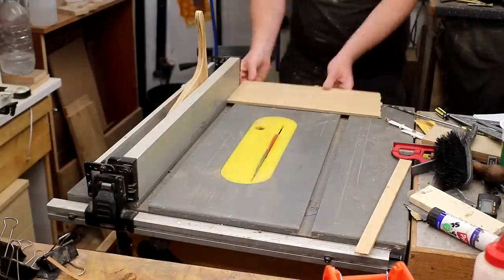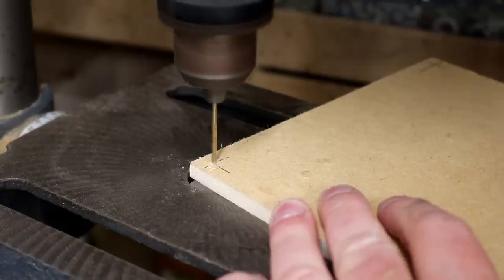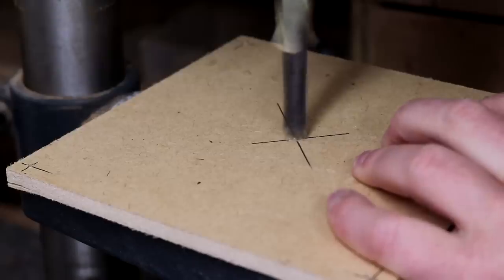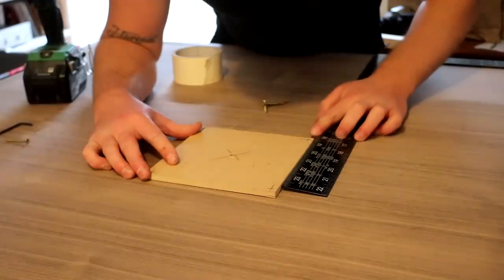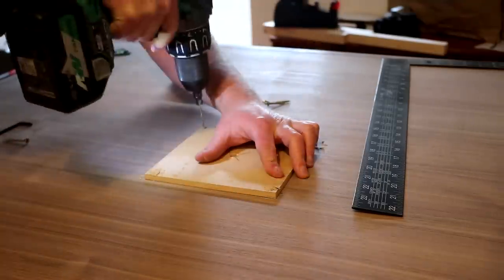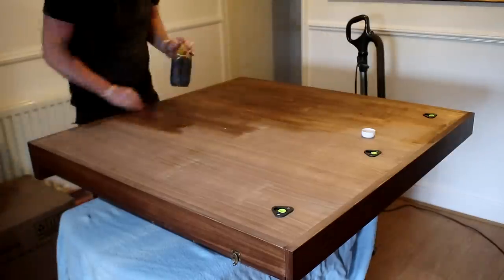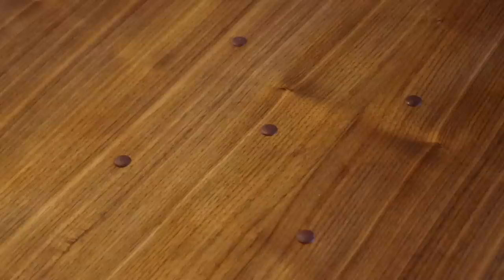At the table saw I cut a square of MDF to make another drilling template. I marked up four corners and a centre point, drilled the corner holes at 2mm and the centre hole at 8mm. I used the 8mm hole to centre it to the centre screw on the cabinet, made sure the template was square to the sides using my framing square, then drilled four holes to secure the dartboard in place. Next I applied finish to the back panel — three coats, de-nibbed with a top coat of varnish. Finally, because the client didn't want screw heads visible, he asked me to add some plastic removable screw caps which I got from eBay.